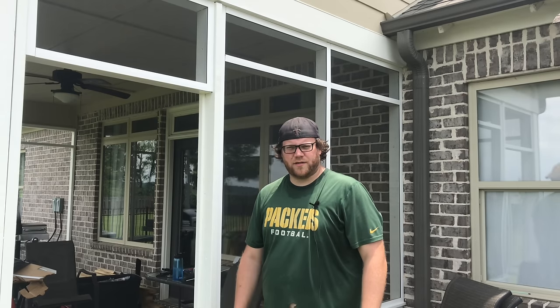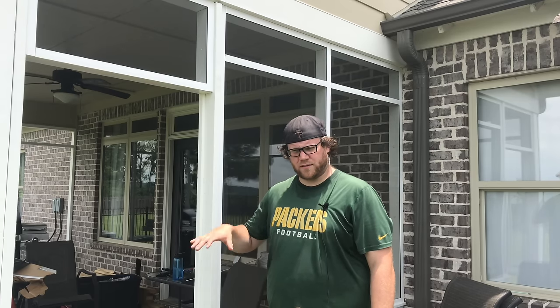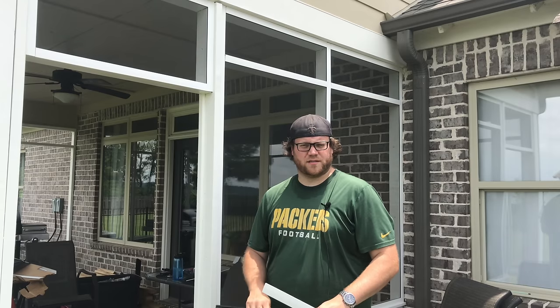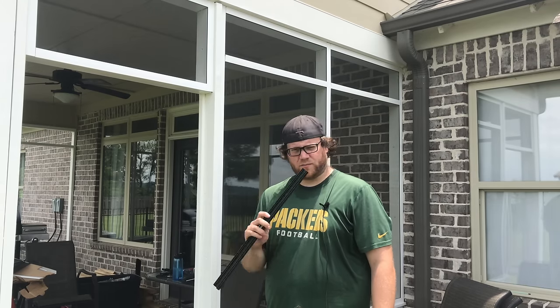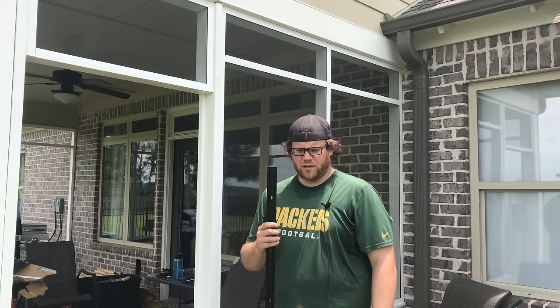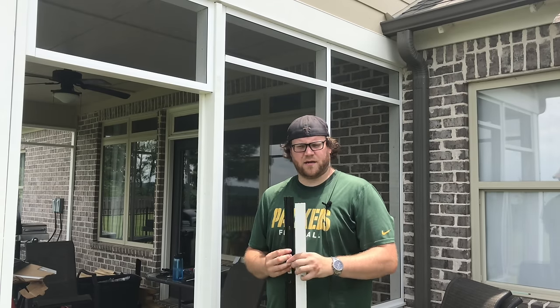Hey guys, I'm making a video today to talk about the Screen Tight system that I'm using for my back patio to screen in the area. If you've already looked up this video, you probably already know what the Screen Tight system is. It's essentially a track system where you install a base on 2x4 construction or possibly 4x4 construction. You lay the track, put the screen in place, put the spline in, and then you put a decorative cap on top.